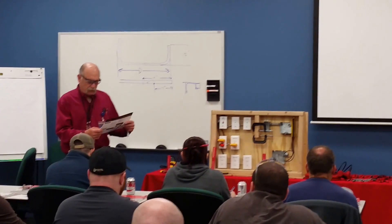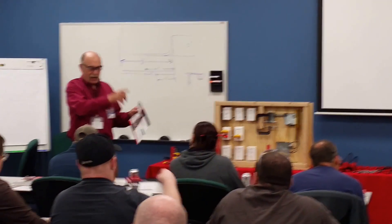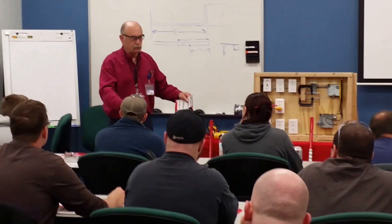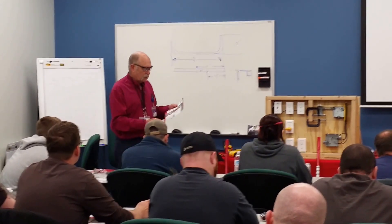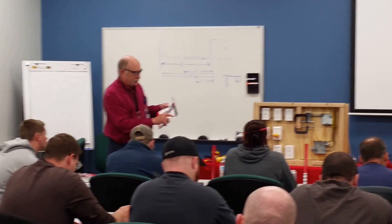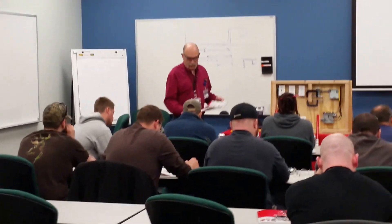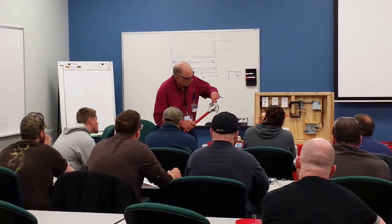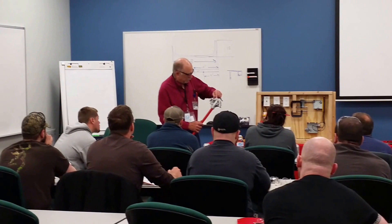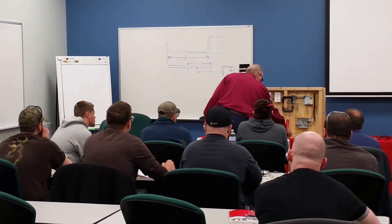So what does it tell us on the chart? We can practice this — we'll take one of the tool boxes, open it up, and have you make a back-to-back bend that fits right inside the tool box, right between those two walls. You measure it, calculate it out, and do the back-to-back. Here it tells you to measure and put a mark the distance on the conduit from the fixed point, and then on the back of the 90-degree bend, align it with the B or the star on the bender to make a 90-degree bend. On this bender there's a star and a B — a little mark that you line up to do a back-to-back bend.